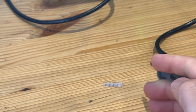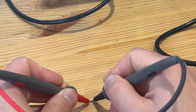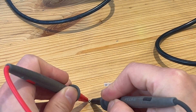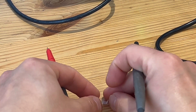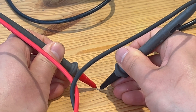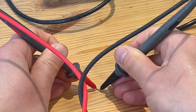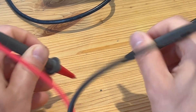We're using a multimeter just to check. This is your three terminal feed-through capacitor — if I probe these two terminals, you can see they are connected. You can hear it — they are connected, there's a pass-through path. The two grounds of course also share the same potential. Now with our X2Y capacitor — this is a slightly smaller package, 0805 — if I check the two grounds first, you can see the grounds are connected. However, points A and B are not connected, so it's not a feed-through. When using this capacitor, you have to use it on a straight line, on one track. That's the difference between the two.